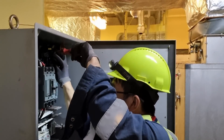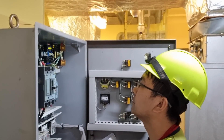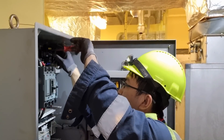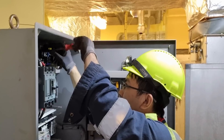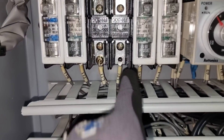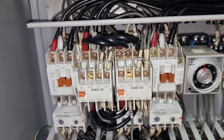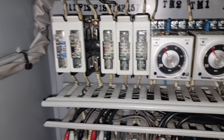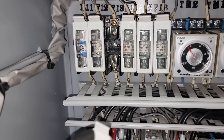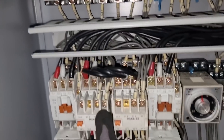After removing the heater's connection, I measured L1 and L2 again and found it is now a healthy circuit. I installed the transformer back and put all the connections back without the heater. In this condition I know everything is in a healthy state, so I can power the system back on.